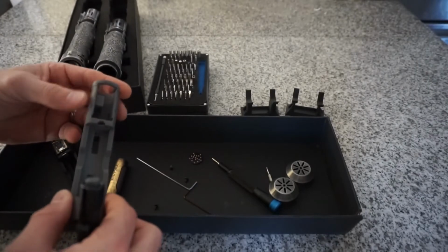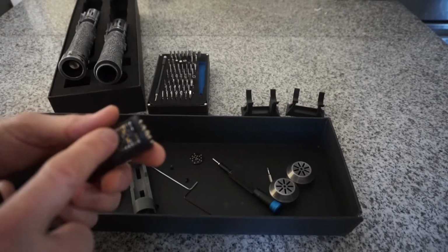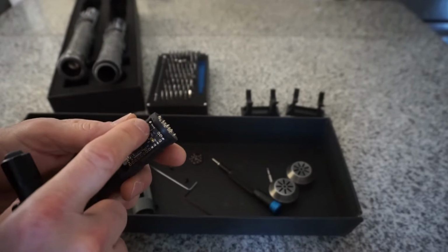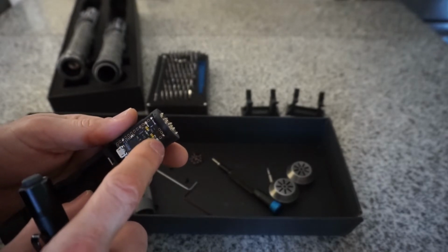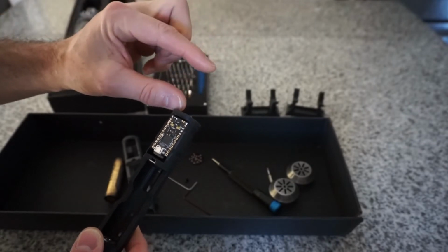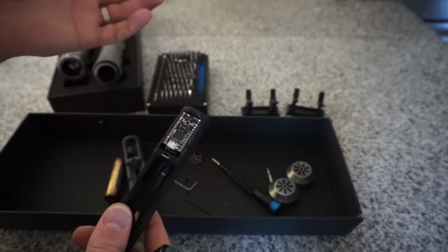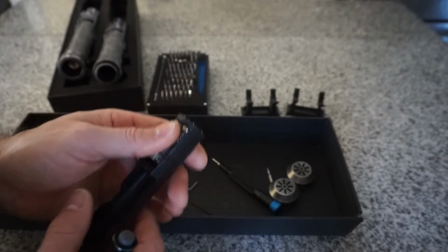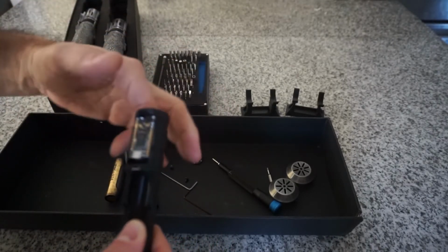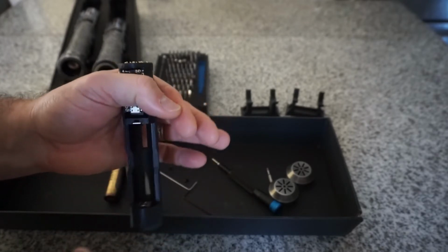And then what I do is I put this down. Now I'll have my PCB, which doesn't have anything soldered to it. I'll take my PCB and put it maybe in a little hobby vise, and I'll wire my LED, my switch wires, and common ground for the switch, and my data pad, data 1 pad. I'll wire those and have that all exit from the top. And then I'll attach my bat negative, my bat positive, and my 2 speaker wires. I'll get that seated in place. Like I said, mine is really press fit. I don't even need to secure it with anything, but if you need to, secure it with some tape, even electrical tape just to hold it in place.